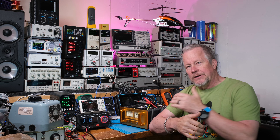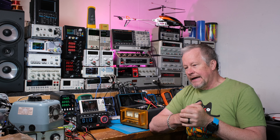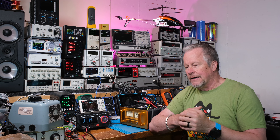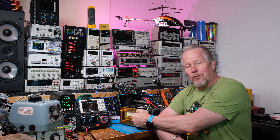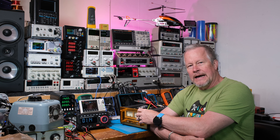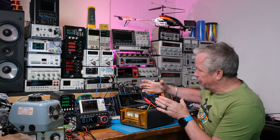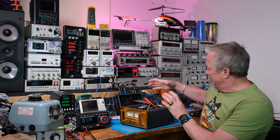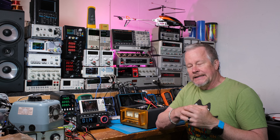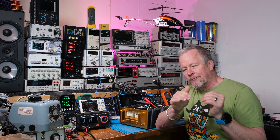In the next video I'm going to do some testing — how much power before distortion, set up the bias again. I had the bias set really hot; when my friend had it, the box got pretty warm after about 20 minutes. You could touch it but you didn't want to hold it very long. It's got big chunky face plates and a lot of heat sinking, but Class A just sitting there is going to get hot whether you're playing music or not, so I want to turn the bias down just a little bit.